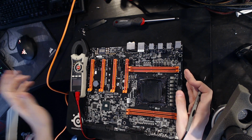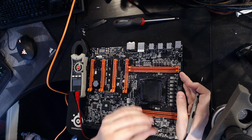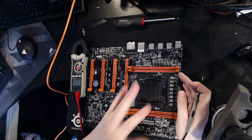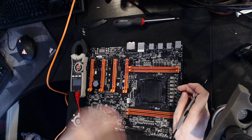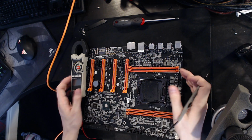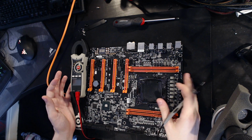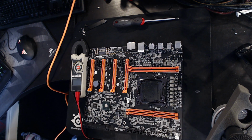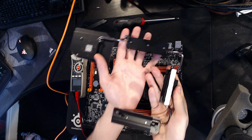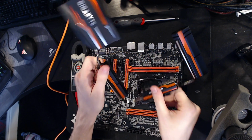as a reference, the 3551s are also a 50 amp power stage, and they will be pretty close to what these end up doing. So at that 300 amps current draw, 300 kilohertz switching frequency, 2 volts output, this VRM will put out about 7 watts per phase. And with an 8-phase VRM, that means you're doing 8 times 7. That's 56 watts of heat. And suddenly, this giant cooling block starts looking a lot more adequate. Because, yeah, that is a lot of heat.